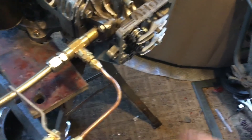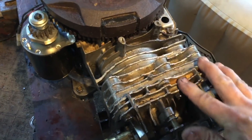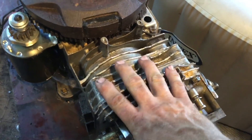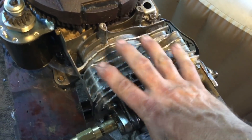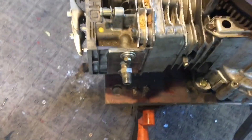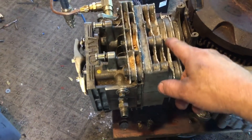It's a uniflow setup. I removed a lot of the fins because you don't want this to be cold — actually you want the opposite. You want it to be rather warm, obviously not hot enough to melt the aluminum, but you don't want it cooling itself. It needs to be at a good temperature for efficiency; otherwise the steam starts condensing when you don't want it to.